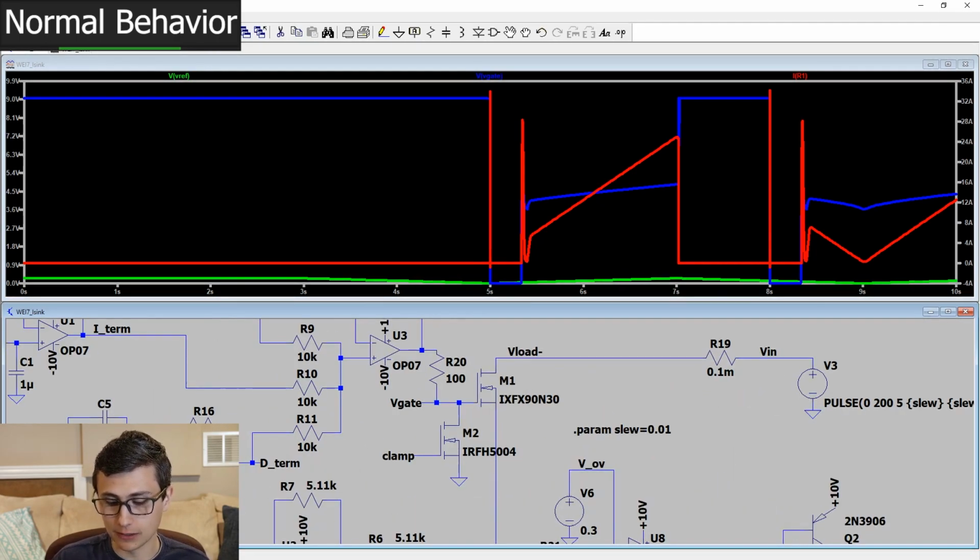And in order to make this work better, right now, this is just a standard FET because I couldn't find a good model for a linear MOSFET. Linear MOSFETs are basically designed for this. They have a much wider safe operating area. They tend to have a much larger gate charge or gate capacitance, but they've got an extended Miller region or Miller plateau, whatever you want to call it. I've heard it called many names. I'm just trying to use them all.